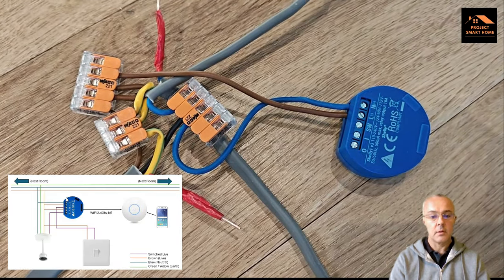With regard to this bundle of cables, you need to be putting this into some sort of junction box in the ceiling — you can't just leave that dangling around because obviously it's not safe with the live terminals exposed. WAGO do connector block boxes that you could put these cables into. You just need to make sure that whatever connection box you're using is suitable for the environment — sealed up and watertight, away from dust and anything that may nibble at the cables. If you're not capable and competent with working with electrics, this is a really easy job for an electrician and they could have it done in just a few hours.